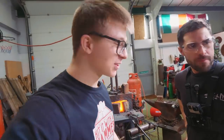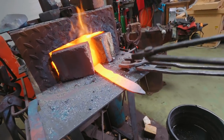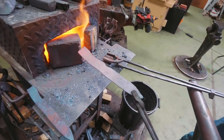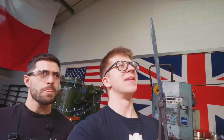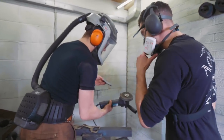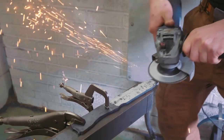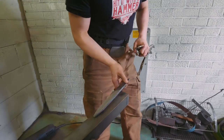So Mike's blade is now forged out — you can take it out of the fire. Over lunch we're going to run some normalizing cycles: heating it up to a red heat and letting it air cool. Someone just made a great in-depth video about heat treatment — Real Engineering has just uploaded his side of our collaboration; I'll link it below. But anyway, we're going to run some normalizing cycles and then go into the grinding room where you'll start grinding your piece, getting it ready for heat treatment. We've done three normalizing cycles now — time to suit up and hit the grinding room.